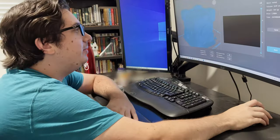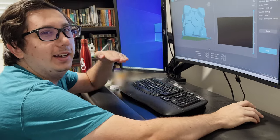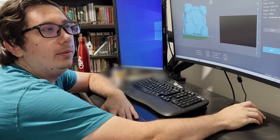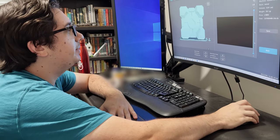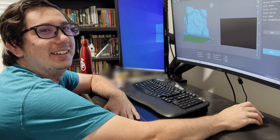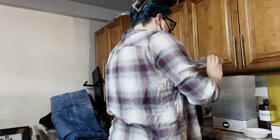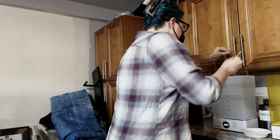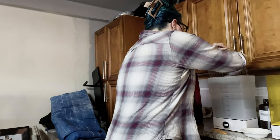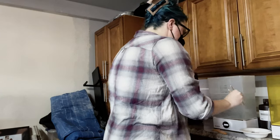Aaron, tell the camera what you've discovered. One of the settings in here got changed and it looks like the model's actually hovering half a millimeter or a millimeter above the support structure, which would explain why it didn't print — successfully printing the support structure and nothing else. Lift the fry basket and put that in the bowl there. Air dry for probably about ten minutes or so, and then we can transfer it into the UV curing station.